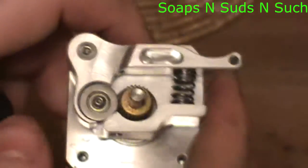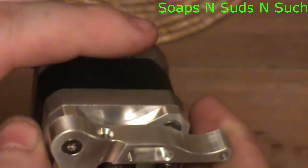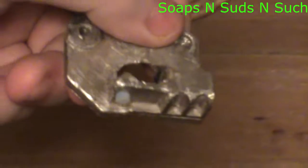We now have installed our new hardware onto the stepper motor, and this can be remounted onto the printer. You can take your old hardware and put it away in the bags in case you need it later. There's also the custom piece I made, which uses a PTFE tube for flexible filaments. There will be more videos to come as I test it with flexible filaments and more — thanks for watching.